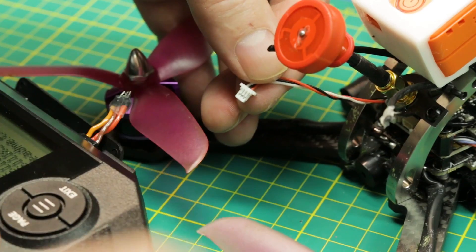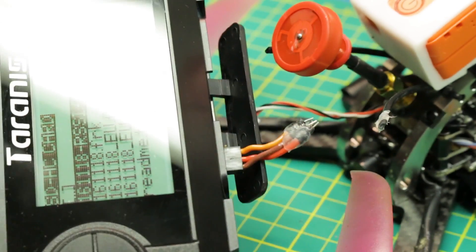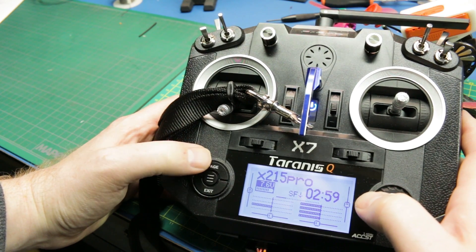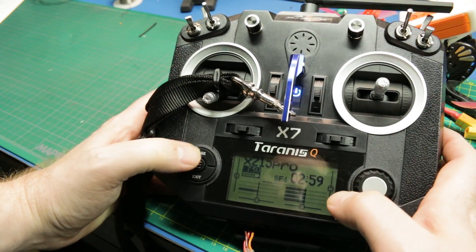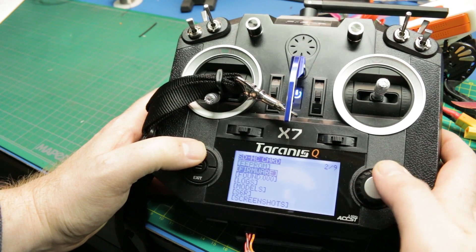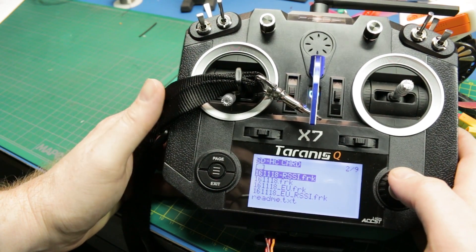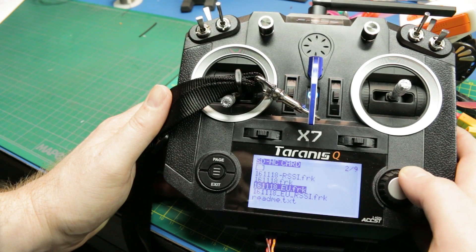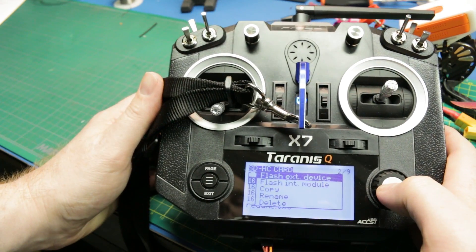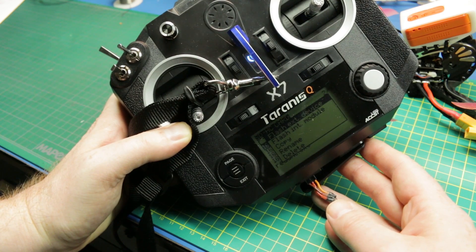Across the bottom of the transmitter, pretty straightforward: ground, red, signal. I went to the FRSky website and downloaded the firmware for the XM Plus and put it on the SD card in my X7. To get there, hit the center button and page, go down to firmware and it shows up — it's the XM Plus. Select it, choose just RSSI — the top one, not the EU versions since I'm in North America — then do a long hold and select Flash external device. Hook these connections up, hold them against each other, and with any luck we'll have new firmware on our receiver.